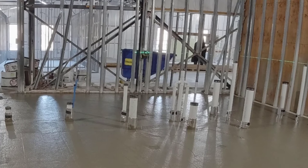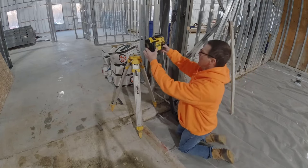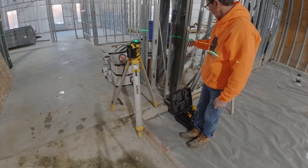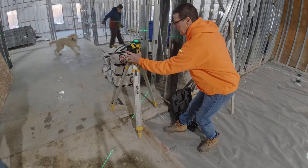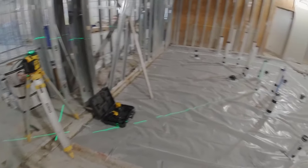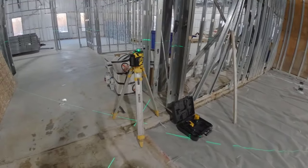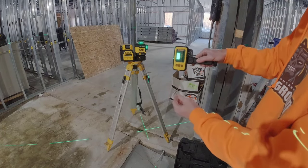After we got it all done, this is it. This line level laser worked really well for us on this job. It's really easy to mount on a tripod — DeWalt makes their own tripods, you just screw it right in and it holds really firm — giving you a nice horizontal line as well as two vertical lines if you need them. Its accuracy was really good on this, and I would highly recommend it if you just need a high-visibility laser to do your work.